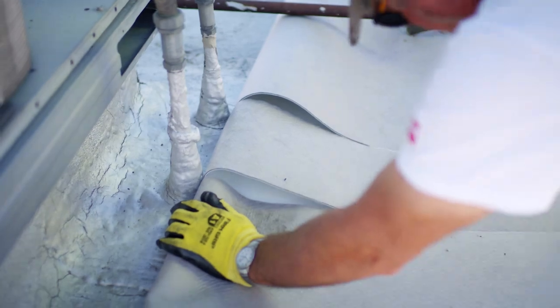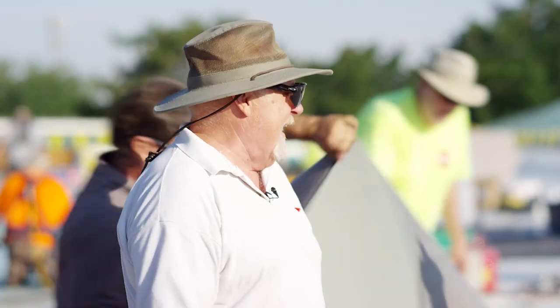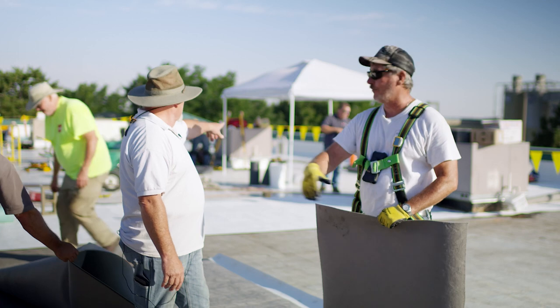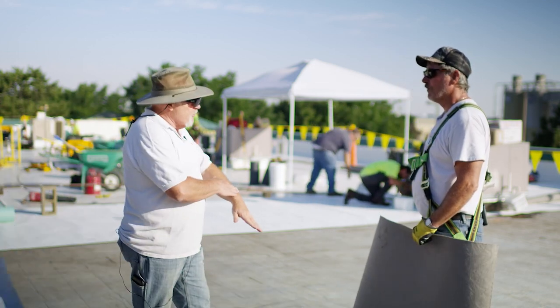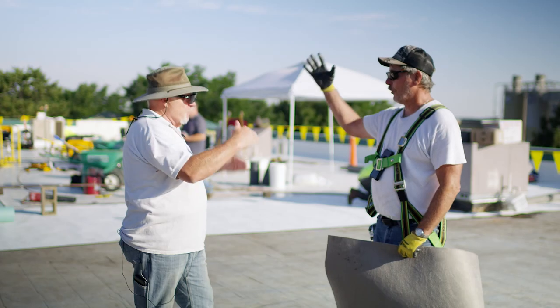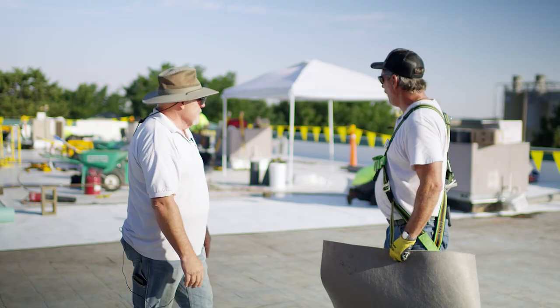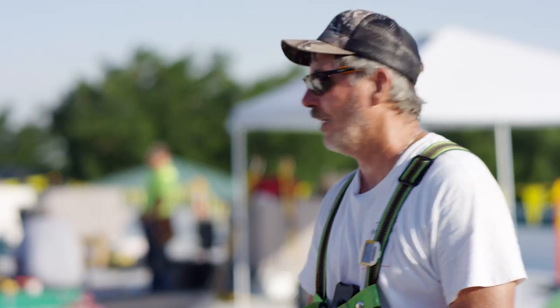There's no right or wrong way to install this, but you're only putting down one sheet — you don't need a separate insulation board, so it can be faster. Now, all the sheets coming this way — because we're changing directions — have to be mechanically attached. If it was butt to butt we'd be fine, but since we're changing directions we need mechanical attachment. So we're going to run a belly band to encapsulate the ends of those sheets running the other way.